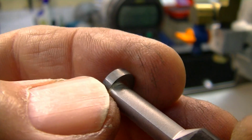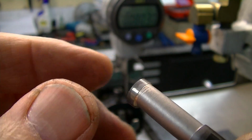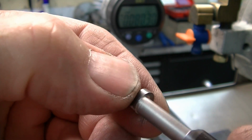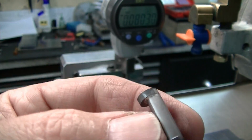We're going to grind this carbide on the back to match this back curvature right here, which is the 0.0213 offset that we showed earlier in the beginning, the very first one. And we only have to go around to 180 degrees each way, but we have to get that to be less than or equal to this back of the bar. So I'm going to set that right now.